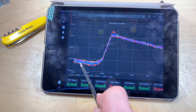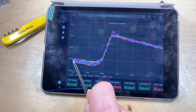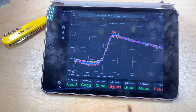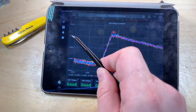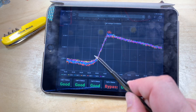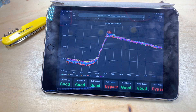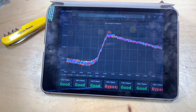The cells got down to under four volts yesterday morning at about 5am - the lowest is 3.95 volts, so they're still quite close together. Red is clearly at the bottom with yellow at the top. After a couple of hours charging, cells peaked at 4.1 volts, and red is now the highest - so that pack is not only the lowest when discharging, it's also the highest when charging. That's cell 5, so I need to look into it.